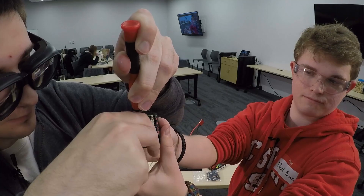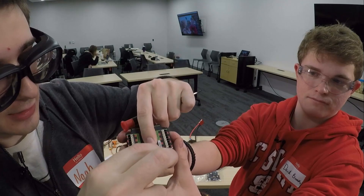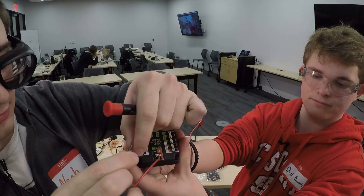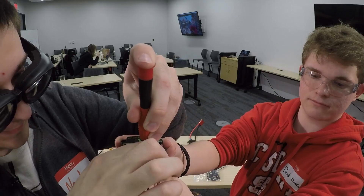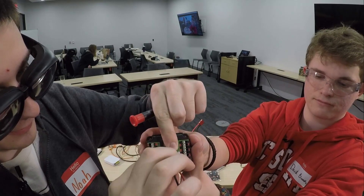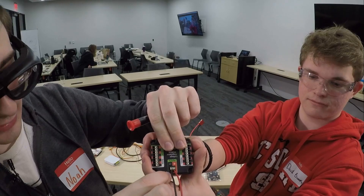Insert the wire and make sure there aren't copper strands going every which way. Particularly you don't want the two sides to touch. Ideally you shouldn't be able to see any of the strands. Press down on the other one — all the way in. Nothing exposed, nice and tight. It's not coming out — this is a good connection.